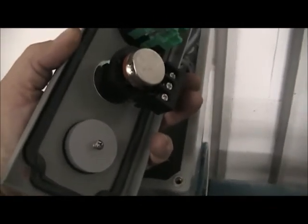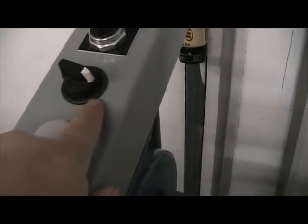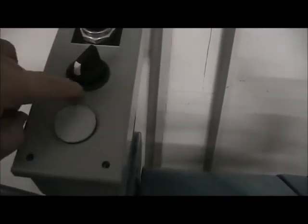I've since found out that we can get this metal case in 22 millimeter, which will actually facilitate using the other buttons that I've purchased. For now I can just use these 22 millimeter to 30 millimeter adapters — it has a little collar, a little shoulder that goes on there. It's actually really nice; it makes it look real neat. The difference is that the little sticker that comes with the potentiometer running zero through nine is actually the same size as this collar, so I can't stick it on there — it would come off eventually.